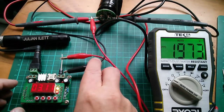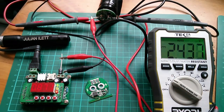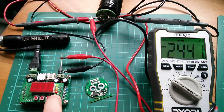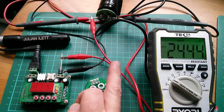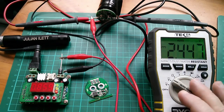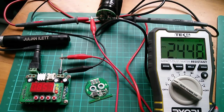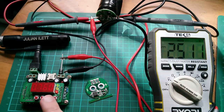I don't fully understand that — unless there's an enormous voltage drop in these wires. They probably are a bit rubbish, but that's a lot of volts. We're getting close to 2.5 volts on the super capacitor — 2.43 volts now. This is showing current, and that's falling because this is in constant voltage mode. As the current falls, the voltage drop across these rather poor crocodile clip wires reduces, so the capacitor voltage is still going up. I'm at 2.51 volts, still with 760 milliamps flowing.